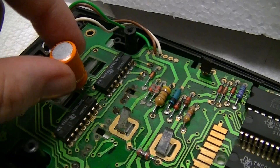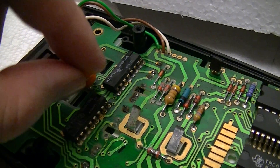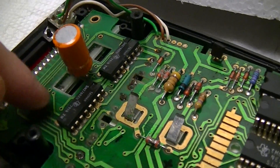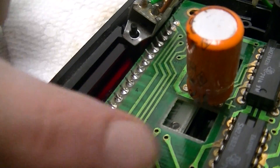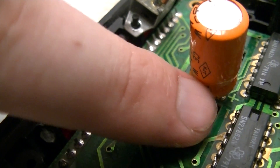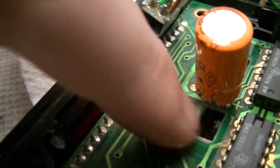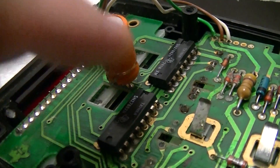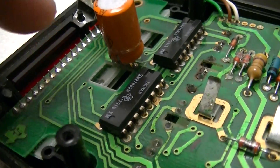In more recent ones, there's another smaller electrolytic capacitor about where this one is, and this capacitor would be over here. Also interesting to note that from the wave soldering bath, it's melted the silkscreen on the board, just poking through that hole in the PCB.